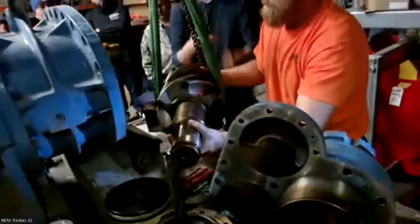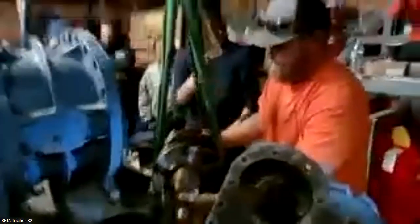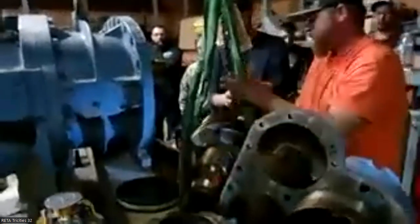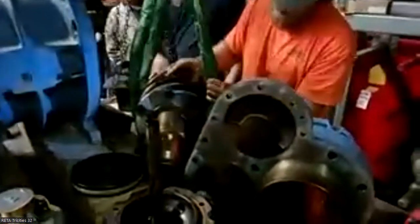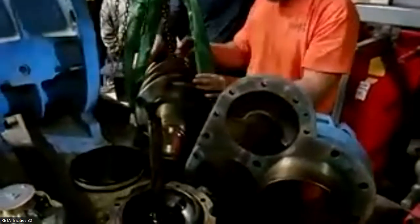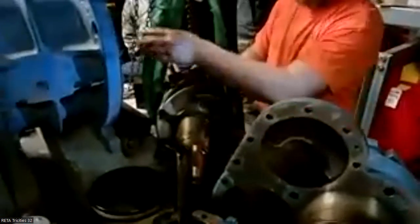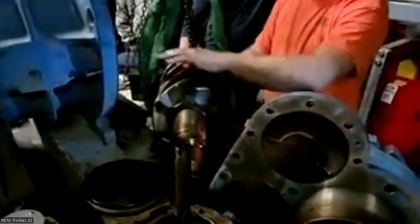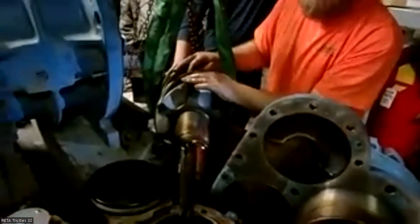I got one that's 12 years old, and I got two that are about 8 years old. So on the rotors themselves, these ones are actually in fairly good shape. We're mainly looking right here and down the valley. That's where the compressing happens, so these areas seal with film oil in the rotor housing itself. Like I said, both of these are in really good shape.